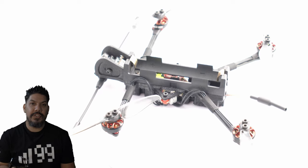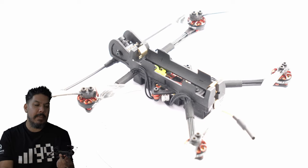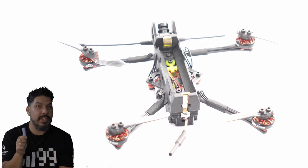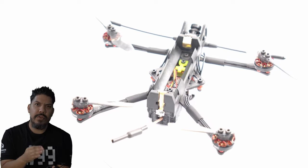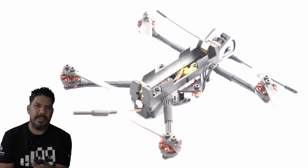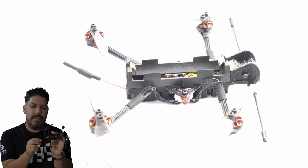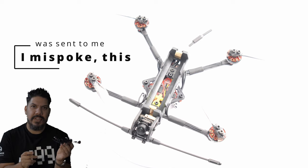Now, when it came out, I was super excited. I actually bought some of these 18650 battery trays and planned on making my own. But then I realized because this only runs off one cell or 3.7 volts, you need a specialized set of electronics or you need some step down converter things. And I just didn't want to have to assemble all that. They weren't readily available. If I ordered them from Banggood, it would take forever. And when it came to them making an actual completed bind and fly version, I went ahead and purchased that instead.